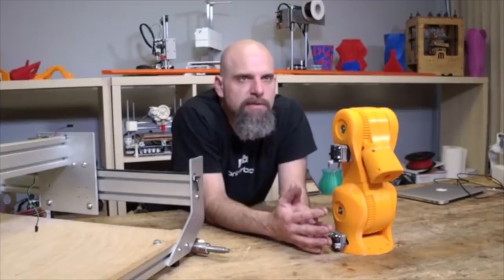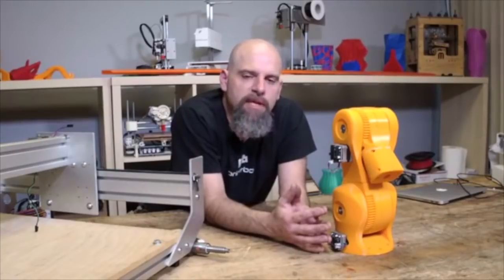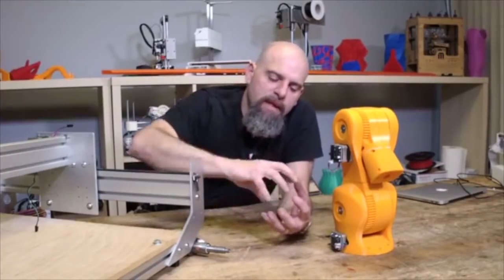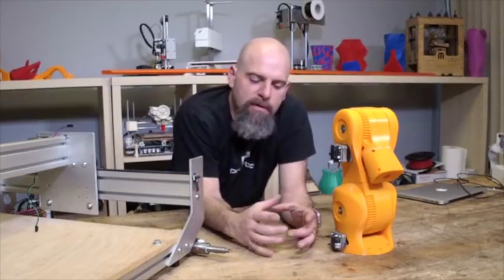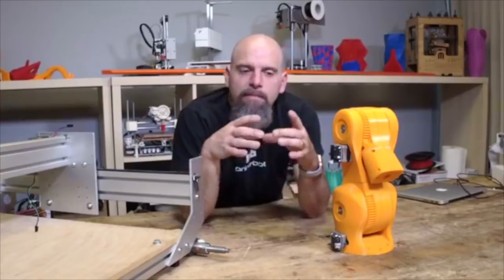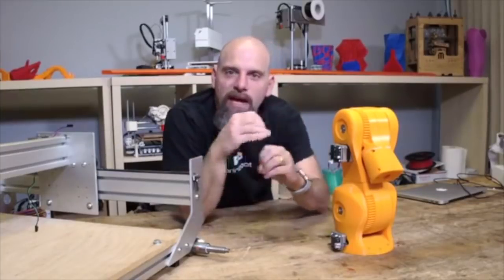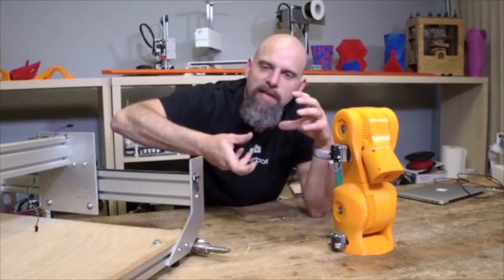So there's a guy who was exploring a sort of cheap version of those industrials, and he was using HTD timing belt. He used thick timing belt to make his outer gear, with the teeth on the inside. And that belt flexed enough that you could put a couple of rollers with bearings that engage an inner gear that is slightly smaller. So you've got an outer gear with 100 teeth and an inner gear with 99 teeth. Because the inner gear flexes from the push of these pulleys, it's actually kind of an oval shape, and so it engages on both sides and rolls around 100 times to 99 times. So it has to roll around 99 times for the shaft connected to it to turn once.